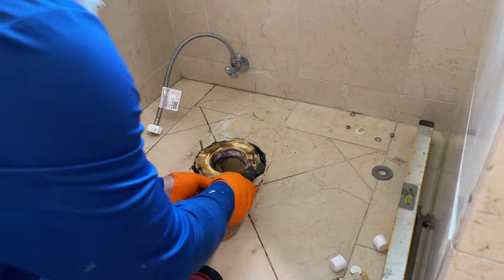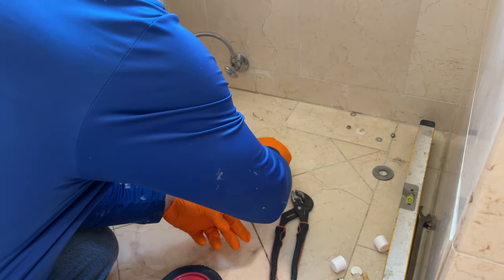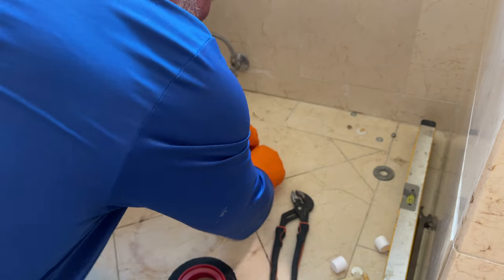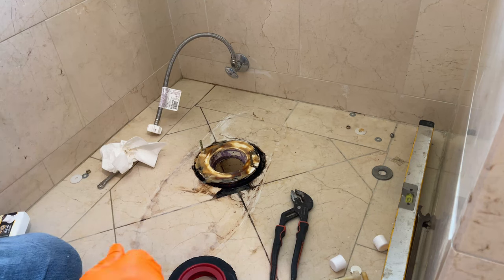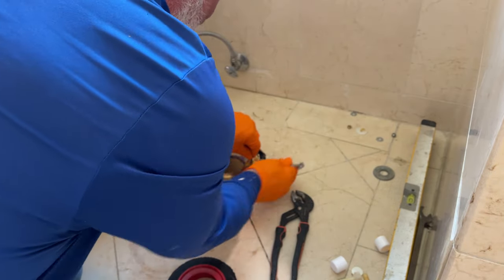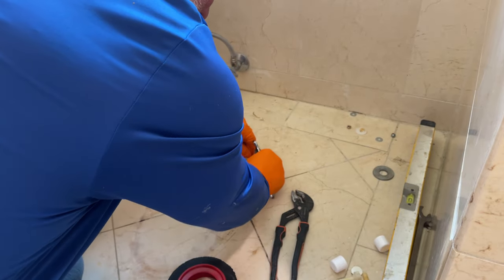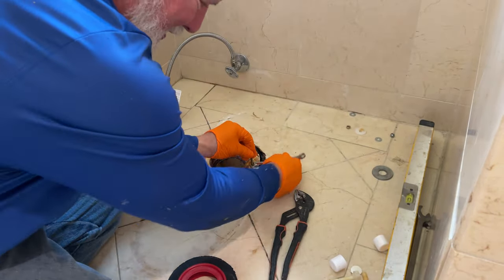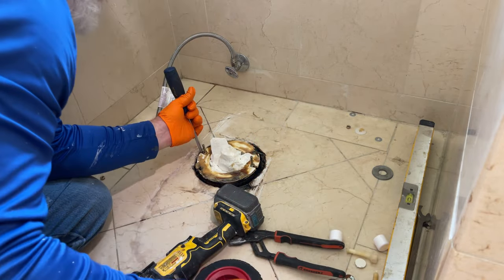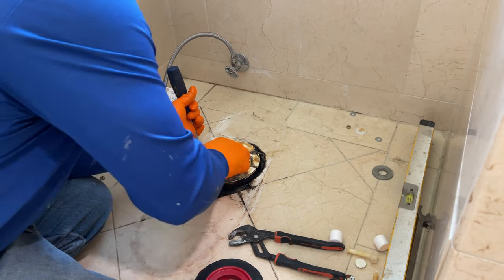So the floor was extremely unlevel and I didn't like the way the toilet set, so I decided to go ahead and take all the water out, pull everything back out, and redo the bolts. Now this flange is actually an extension flange, that's why it looks so weird. So what I decided to do is take and put nuts on that and tighten it down really tight so that it couldn't go anywhere. I think that was part of the problem he had on the older toilet, where it was sliding. And then instead of putting back the wax ring, I installed a new waxless ring.